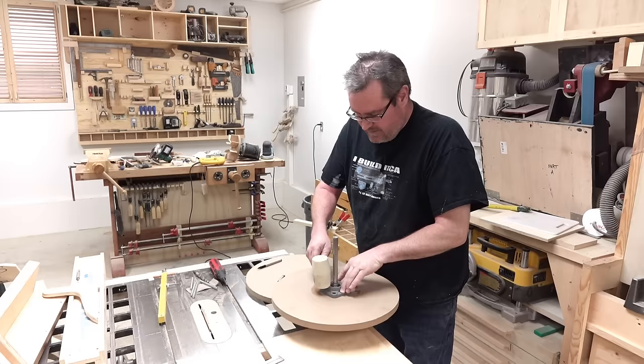I need a piece of plywood to make an adjustment collar, you could say. This is gonna have a 5/8 inch hole in it, and it's gonna bolt right onto that frame member, and I'll be able to move the collar around to adjust the wheel. Here's the plywood block, 5/8 inch hole here, and 1/2 inch holes over here. It's gonna slip onto the shaft. And what I'm going to do is I'm going to clamp it in place, and then I'm going to drill 1/2 inch holes through the frame member as well. And that'll be for the bolts that hold the plywood block in place.